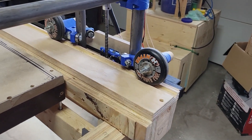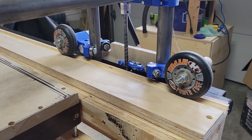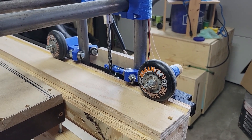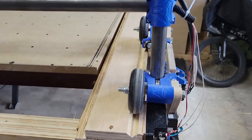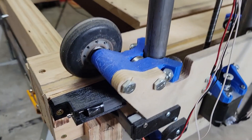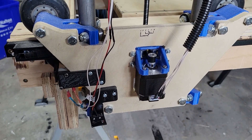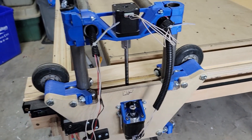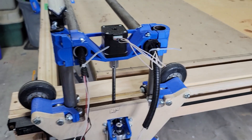The wheels are standard 76mm inline skate wheels — I couldn't find the 60mm wheels the plans call for. I had tons of roller blades from Value Village. I had to make some adjustments on the back side of the wheel, putting a small brass shim in there to keep everything stiff. Standard NEMA 17 motors — more than adequate. I've never cut aluminum; I've only ever cut wood. Wiring management is not my specialty.